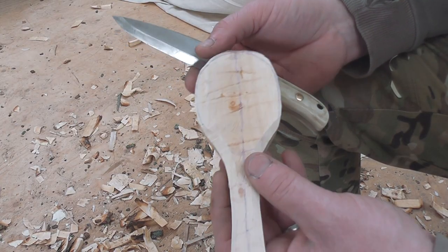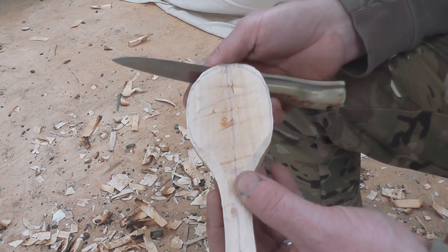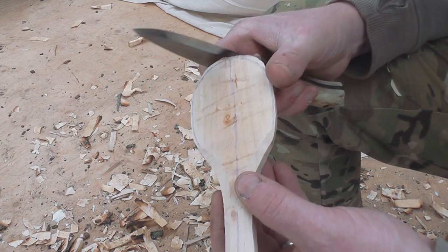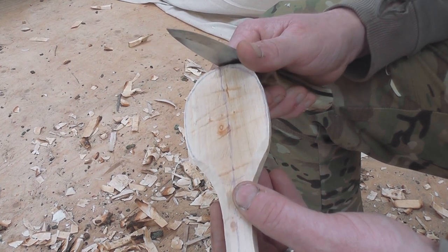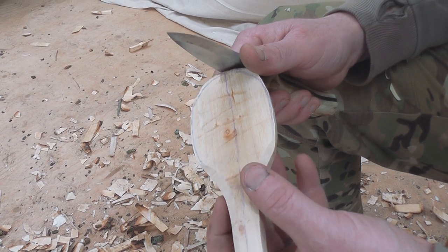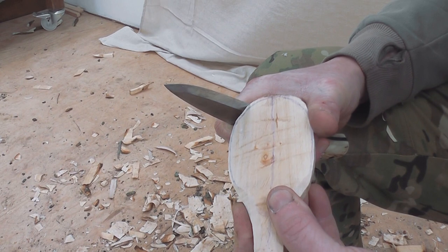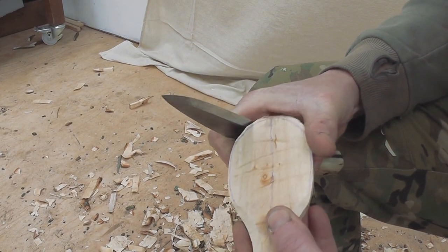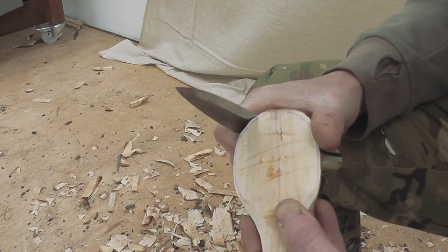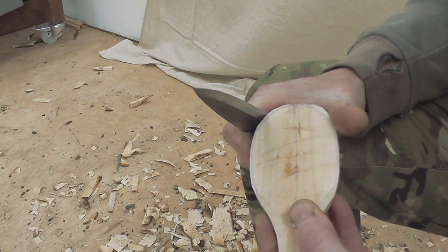So a cut that we can use now for working across the end of the bowl is to use this grip where we're again cutting back towards ourselves. Now the classic error here is people always cut back in towards their thumb and that's real bad news. So when you are using that grasp, you hook your thumb right round out of the way and then you're going to cut into this void where there is no flesh. You cut in between that thumb and the forefinger, just like so. But you can get lots of power and work towards your line.